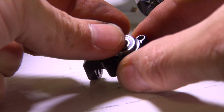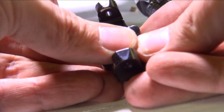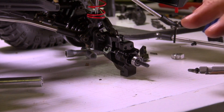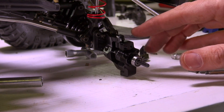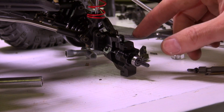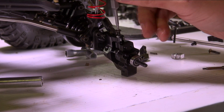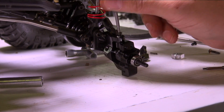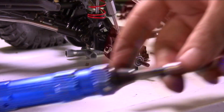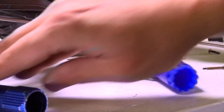With the collars in, I'm gonna go ahead and place the bearings. I am gonna use some Loctite because this is aluminum on aluminum — bar none, you can always guarantee that you're gonna have some sort of issue with your screws falling out on a mechanical piece that moves back and forth when it's aluminum. Just using a small amount of blue Loctite, starting to thread it down. Notice I'm doing it by hand so I can feel the precise amount of pressure I'm putting on — then just tighten it up a little bit because I don't want to wreck those threads. They feel pretty strong though, which is great.